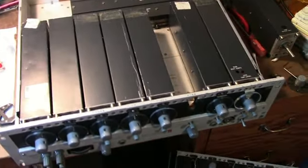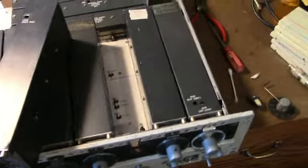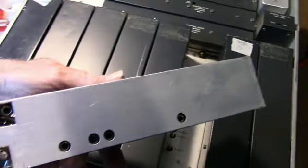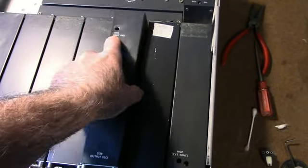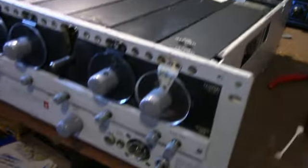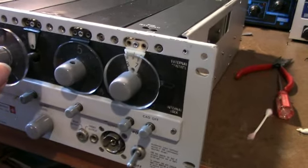The whole system is modular. Here's one of the decade units and they connect to the mainframe — there are banana jacks that mate with banana female connectors on the bottom. So you can insert a decade like this, and there are illuminated lamps in here that show you which decades are connected. Then, of course, the knob will fit on the front.